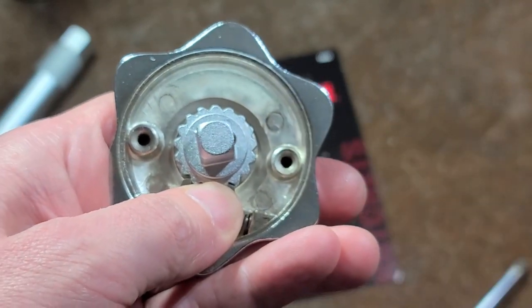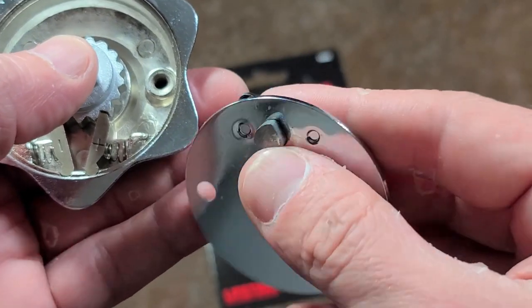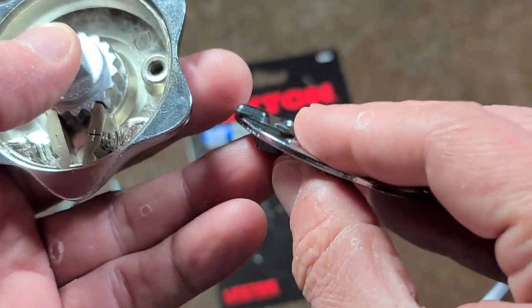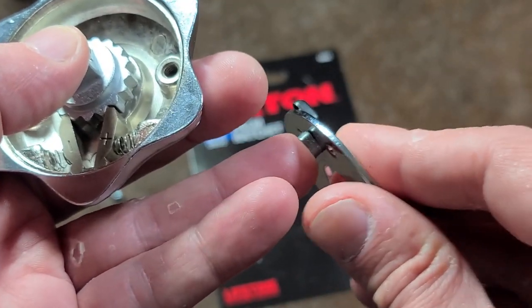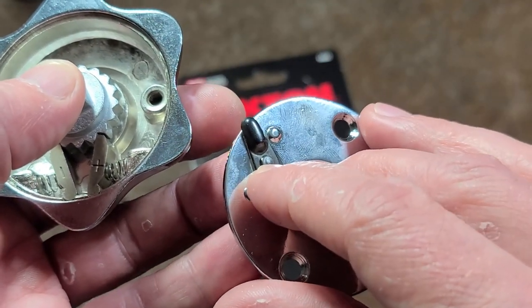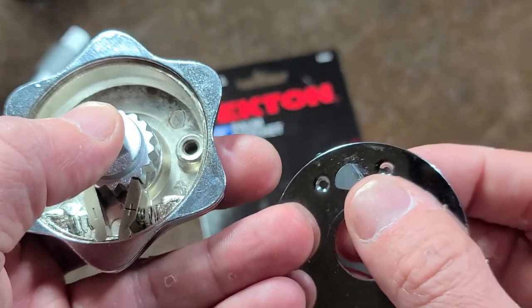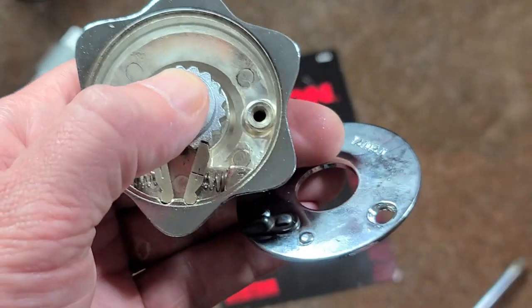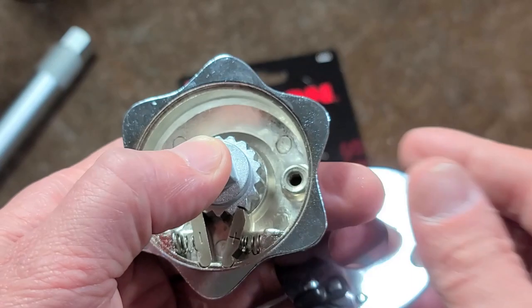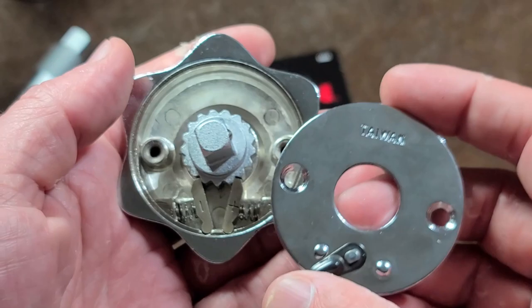It's like somebody put it in a sandblaster and then forgot it was in there. The anvil is of course steel, so this is going to be a little cast zinc piece. If this ever gets you in trouble with the little lever, all you do is pull out the plate, set it so the cast piece is relatively well supported, and just a couple of really light taps with a hammer to re-expand that piece of zinc over the top. It's not that hard of a lever to raid from another ratchet or even make yourself. If it fails on you and falls apart, apparently Tekton will take care of you.